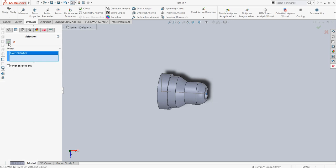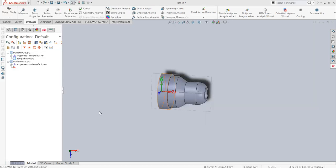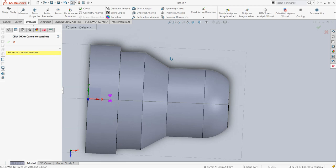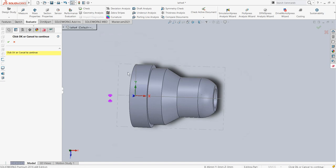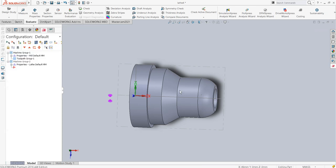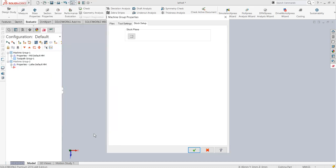I select the location of Z and preview the lathe boundaries. Now you can see the lathe boundary came the way we want — only this portion of the workpiece will be removed; this portion will remain untouched and go inside the chuck jaw. I confirm and say OK.